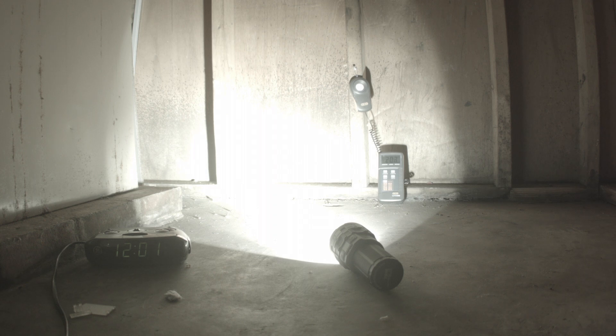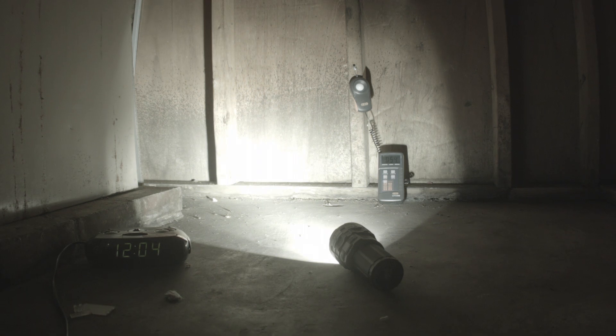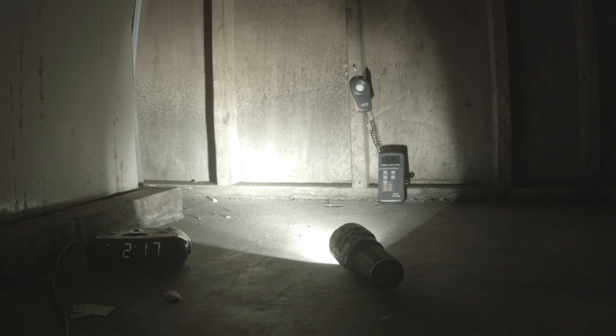High mode steps down too, because my measured 7,000 lumens is still too much heat for a light this size to dissipate. It declines more and more, and at about 3 minutes in there's a hard ramp down to 25% of initial brightness. At 1 hour we're at 22%, at 2 hours 18%, at 3 hours 12%, and it shuts off at 3 hours 6 minutes.